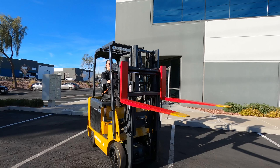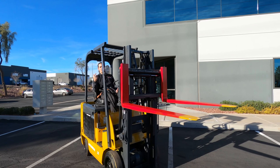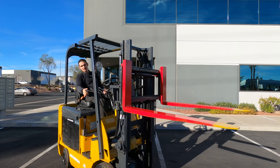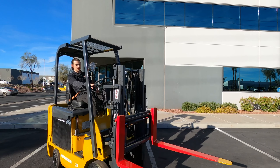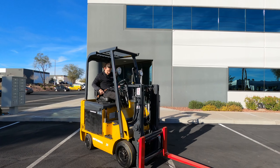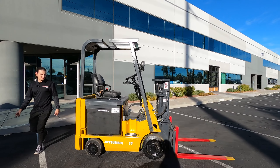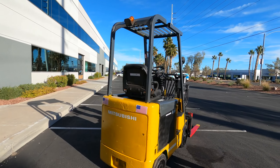You can tilt with the second lever — push down to pull towards you, push up to go away. We're going to bring the forks back down. We've got your side shift — push forward to go left, pull down to go right. This forklift is also plumbed so that if you ever wanted to add a fourth attachment, like a fork positioner, you could do that. If you move it, you'll hear the hydraulics engage. So it's ready to go if you ever wanted to add another function to the machine, which is cool.